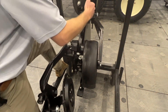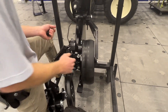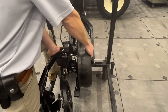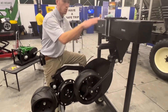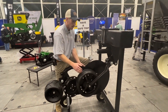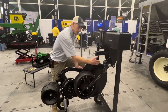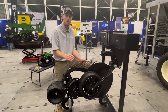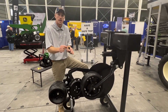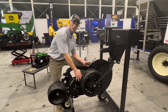This wheel right here — that is not our gauge wheel; that does not set our depth. The toolbar height sets the depth. This keeps the dirt from blowing out. When this blade cuts through it at an angle, it keeps it down, keeps it firm, allows everything to stay tight and keep that low disturbance.